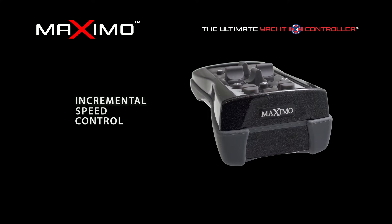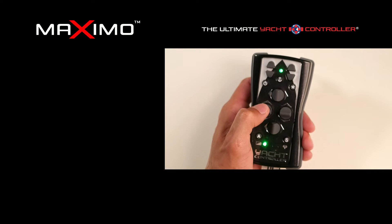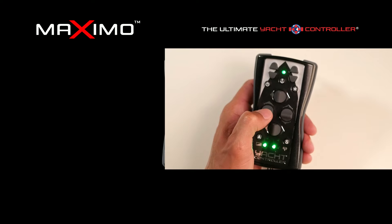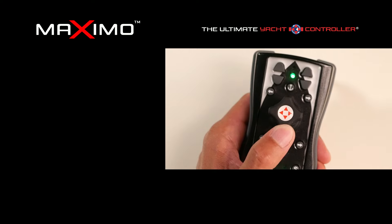To demonstrate this, we'll talk first about incremental speed control. The Porsche design toggle controller remote remains very popular in the market, and we wanted to bring this speed control option for customers who chose not to go with the wireless joystick. With the toggle control, you have a lever pushing down on a keypad membrane, versus a wireless joystick where a swing or sway allows for proportional control.